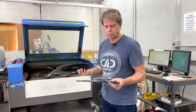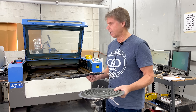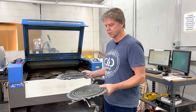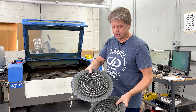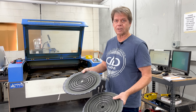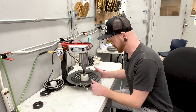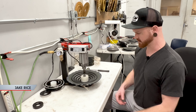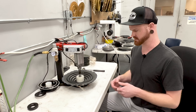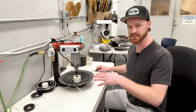All of our spiders are tooled in the U.S. — it's all U.S. fabric. They get shipped to Oklahoma City where we use our CNC laser to cut them to individual sizes for those speakers. This spider is designed to work with either a three-inch or four-inch voice coil setup. The 9900s use a four-inch voice coil, so we're setting the laser up to cut 9900-size spiders today. Since we upgraded to the iron cloth spiders, which are so saturated with resin for good longevity and toughness, we have to press them with our pneumatic press and break up the resin before we cut them.